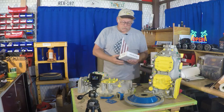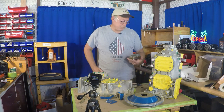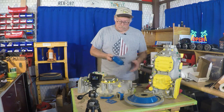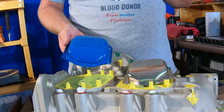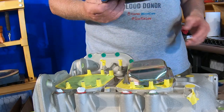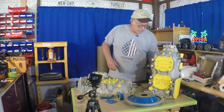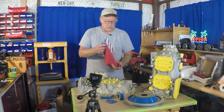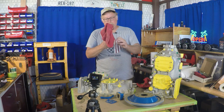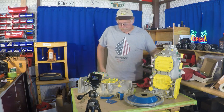One of the things we did do: when you get your new cylinders — we're putting in four brand new Millenniums — you get a beautiful cad plated valve cover, but what we decided to do is bead blast our old ones. We've primed and painted the original OEM valve covers. These are going to be the jewelry when we're reassembling this engine. The pushrod tubes are all painted. The intake pipes we're leaving bare because that's where a lot of clamping gets done — those are just going to be a cad plate finish.